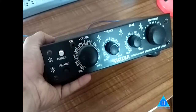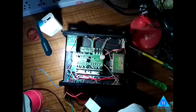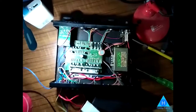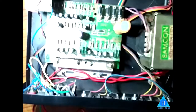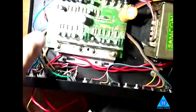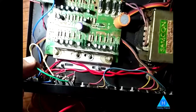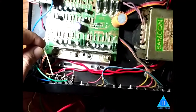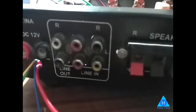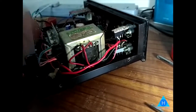This amplifier is 10 years old. There are FM and AUX inputs. We will look at the internal side — there is a stereo board. We decided to use the line input: Left, Right, Ground. Yellow is ground, blue is left, green is right. I will wire the pins accordingly.